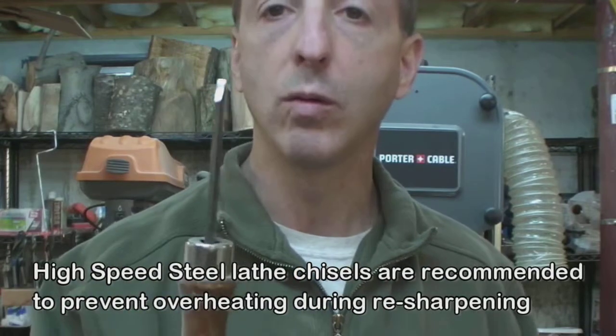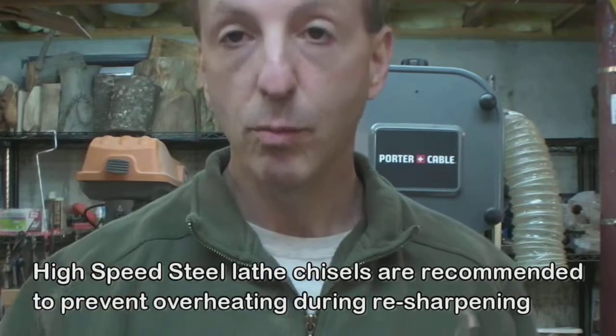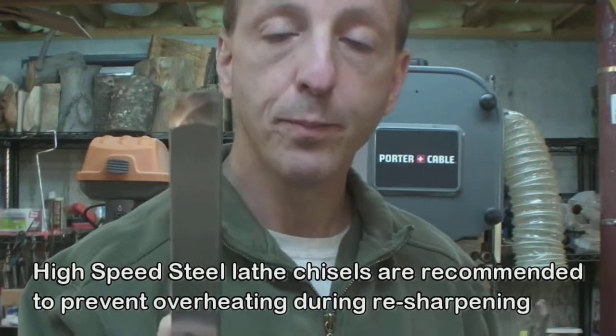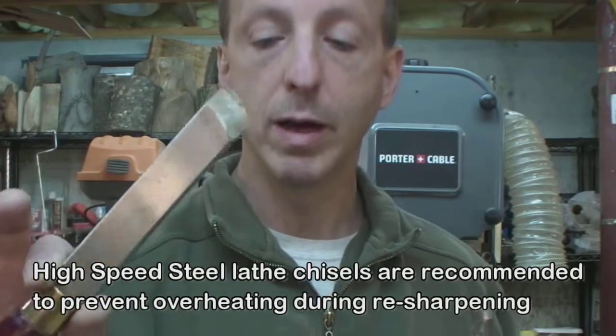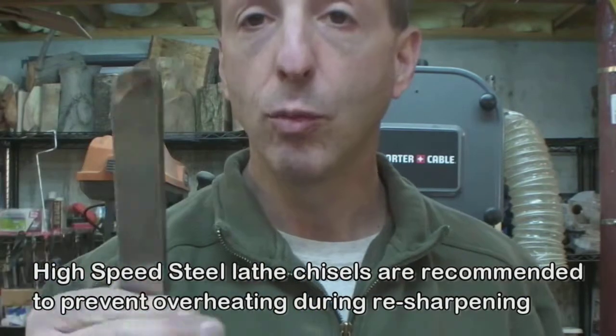Okay, beyond that, here are the tools we're going to work with today. First thing we're going to be working with is a parting tool. This is for making slots, gives us the right size. We use it for a bunch of other items. I'm going to introduce you to the skew. Great tool. I do a lot of my turning, sizing, and finishing with a skew. I can do some projects with this and nothing more. And last, the detail gouge, I'll show you how to use this today, especially on the top. This is a super useful tool. It's great for making rounded edges, and you'll see that too.